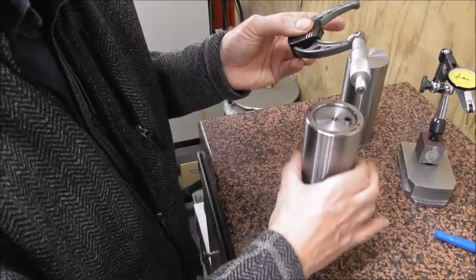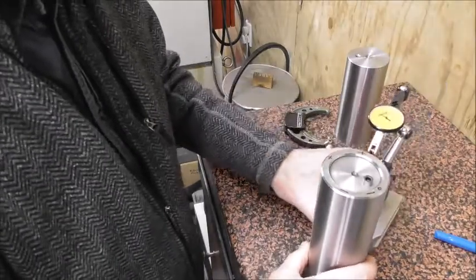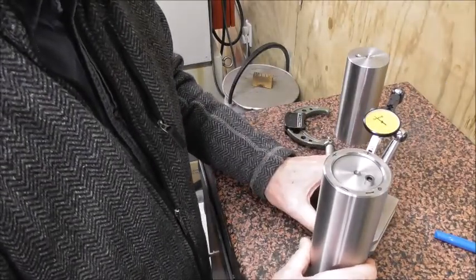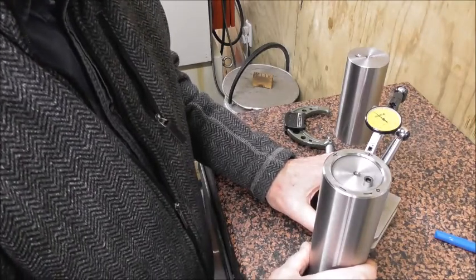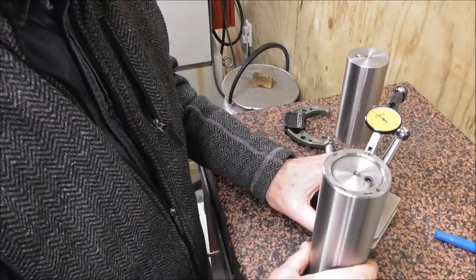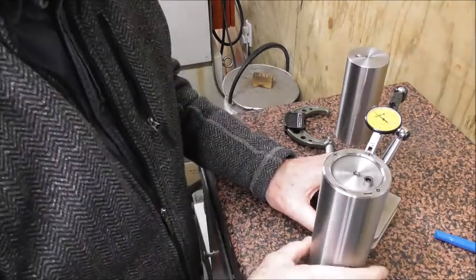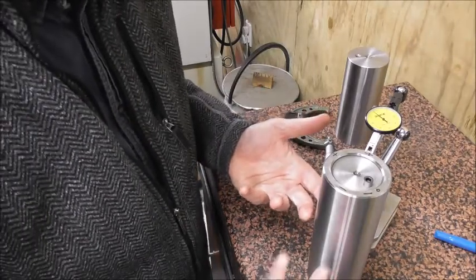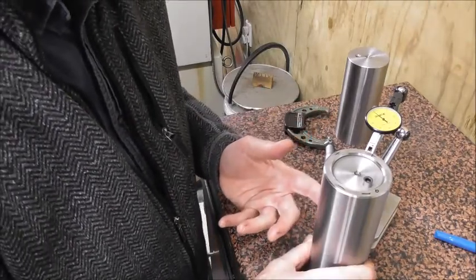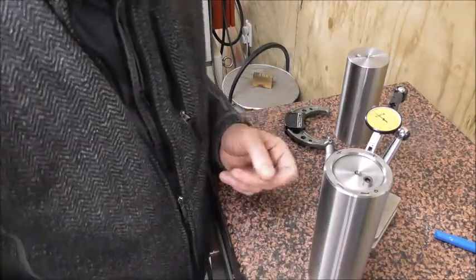As far as I can measure, it's within a thousandth of a millimeter of parallel and round, and when I check it with my squareness comparator it's within a thousandth of a millimeter of square. It's really interesting to have the time on the weekend to take it a level higher and get closer to precision. If you wanted to get to a millionth of a millimeter it's a whole new world — you'd need a temperature-controlled workshop and much higher-end equipment. Thanks for watching, cheers.